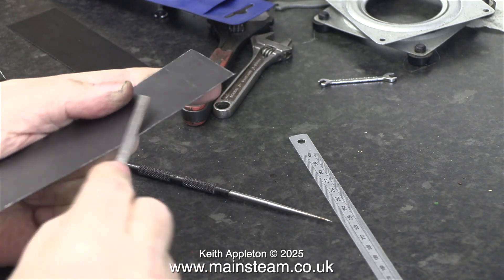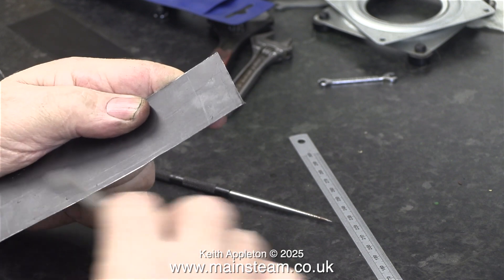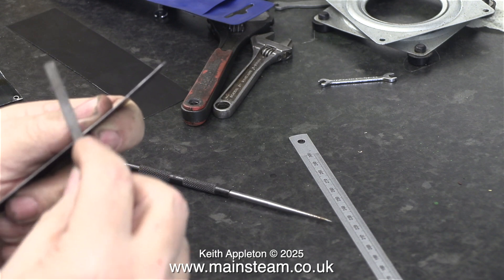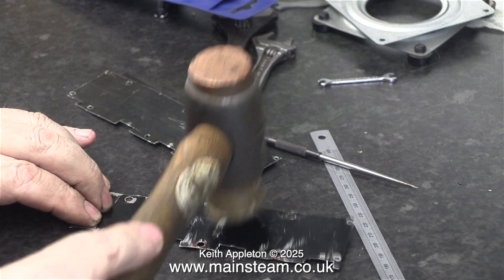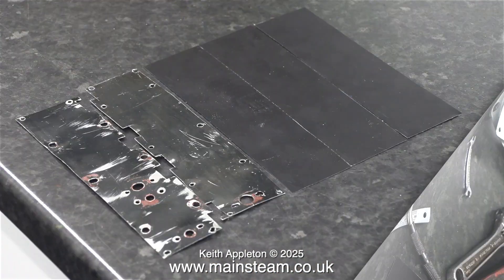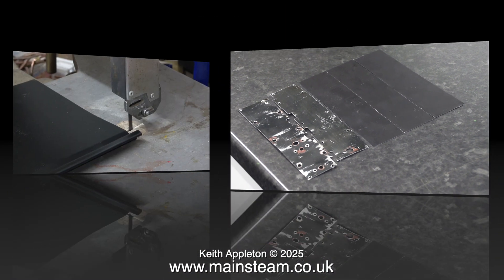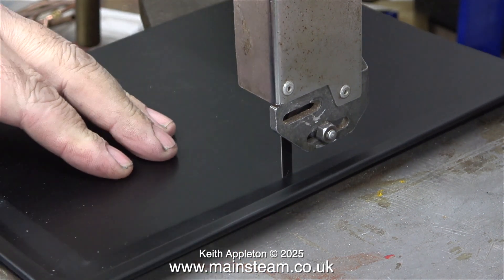This piece of cladding would need painting to look good because you can see silvery parts at the edges. If you had a nibbler that would be useful, but it would possibly mark the surface of such thin metal. I thought it would be a good idea to flatten out the original cladding to use as a pattern for the next method. Here's the original cladding with three pieces of baking tray — I made three to allow for a bit of human error.